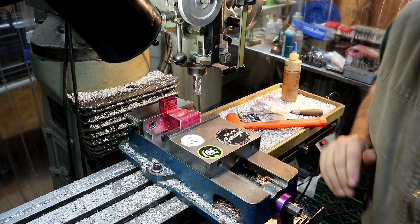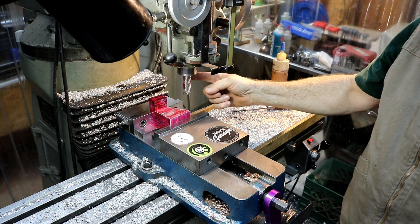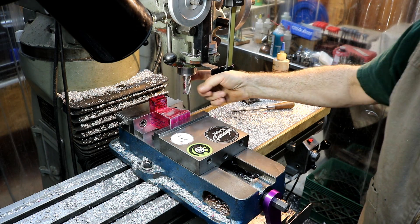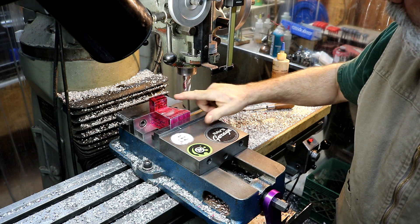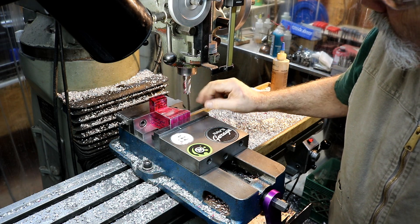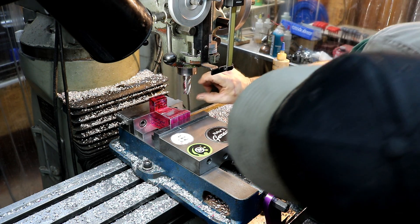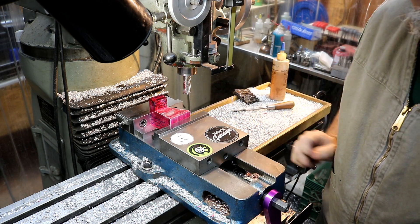I'm using a three-quarter inch high speed steel Niagara end mill here — this one's non-center cutting actually — and this thing is doing a fantastic job hogging this stuff out. For the finished pass it's just fine for what this is. Remember, this was made out of a casting originally, so we're going to continue with this. I can do a nice inch-and-a-half depth of cut with it, which is more than enough for this whole project, so we're just going to stick with it.